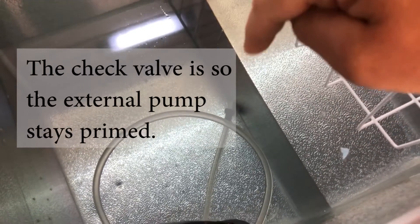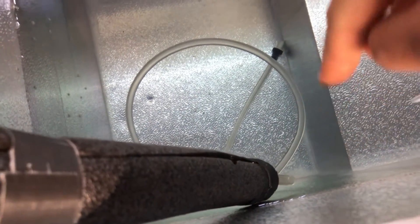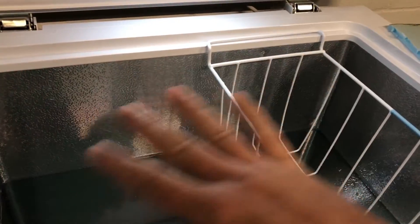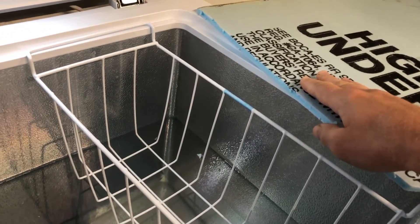Down inside it's very simple. That's quarter-inch vinyl tubing with a backflow preventer or check valve on it — that's the input for the transfer pump. It gets sucked up from the bottom where the colder temperatures are, goes through the transfer pump, up through the tubes, through the heat exchanger upstairs in the bedroom, and then comes right back down, expelling at the top where the warmer temperatures are — creating a natural flow. The lid is mainly just a vapor barrier; leaving it open wouldn't warm the water up much at all, and it probably adds only a little extra efficiency.